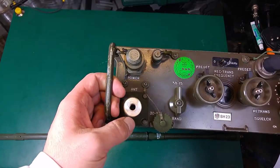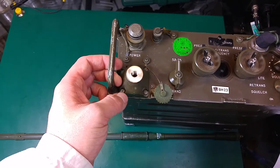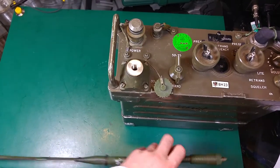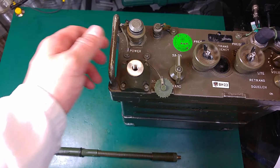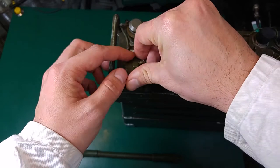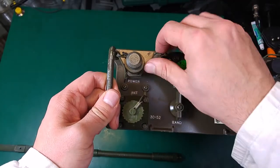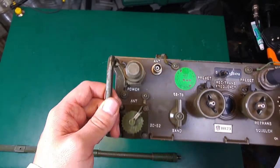And the long antenna is touching an element inside, and that was making the difference between using the short and the long whip, because we are using the same socket and the connector is longer. I'm going to buy that and then I'm going to show you. And of course, we can also use an external antenna by using the BNC connector over here. That's how we can connect.